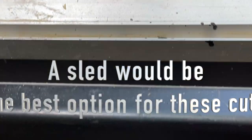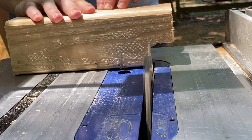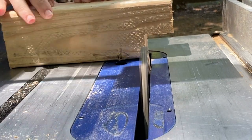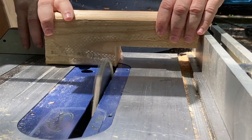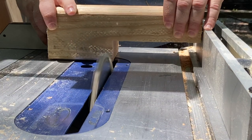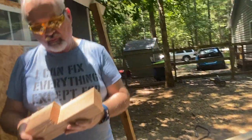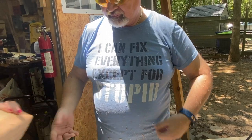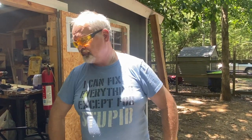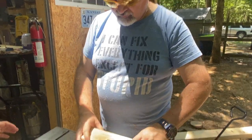You can do this cut even without a dado blade — you just need to make more passes. With a hand saw you make a lot of passes and because you can't be as accurate, you use a hammer to break the resulting ears you create. It's a fast way to do this without very specialized tools. I'm using the dado blade here because I have it, and as I just put on screen, a sled would be the ideal tool for this cut — more enjoyable and safer.